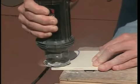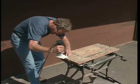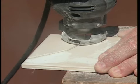We're also using another tool for making some of our tight curves. Now this is a small router equipped with an abrasive bit. It kicks up a lot of dust, but it's an easy way to cut thin tile.